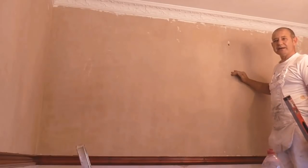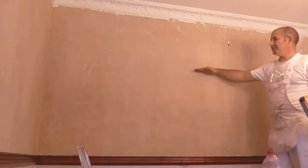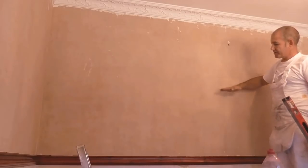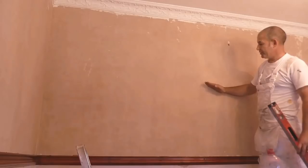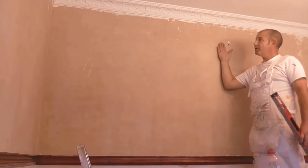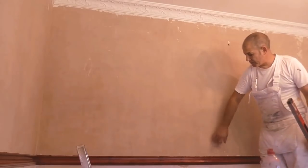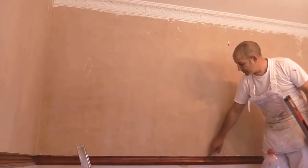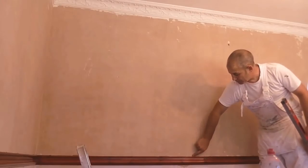If it was cross-lining for papering then I would stay with the snap line method, because it's only a matter of working out the correct spacing. You don't necessarily need your joints to be in line because you're hanging a paper over it. What it avoids is wedges, so you're not having to mess around with very fine thin ends of paper — because if you miss them, leave them, and put your thin vinyl paper over, those edges will show.